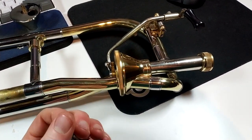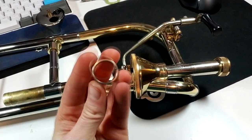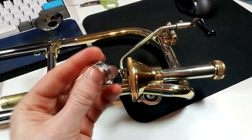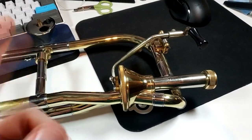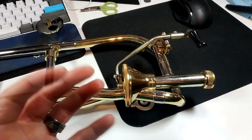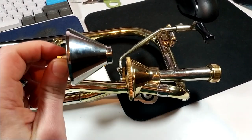What Mike came up with to fix this problem, both on axials like this and his own rotor design, are ball bearings. If you don't know what they are, basically you have a little track, a bunch of little tiny metal balls, and then another track on the inside. Instead of the metal just moving against metal, it's the balls inside the track that are actually doing all of the moving. Ball bearings are used in basically every application of circular movement in the world — they're in your wheel hubs on your car, all sorts of industrial applications. They're one of the best ways to eliminate friction and wear on parts that have to move in a circle.